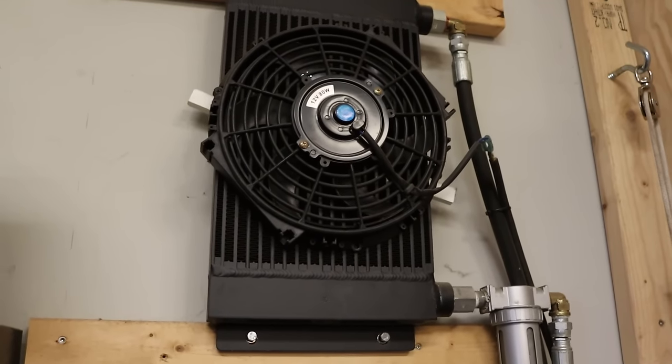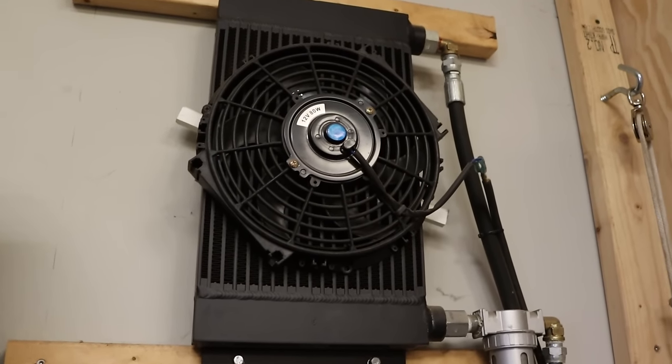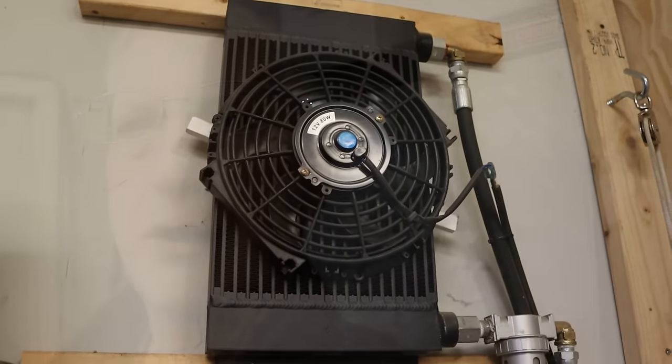As you know, an air compressor, when it runs, heats the air, and when you cool it, the hot air can't hold as much moisture anymore, so you get moisture condensing out, so hence the name condenser. Another option besides purchasing or assembling a condenser unit like this is to run copper lines in an array of U-bends and mount that on the wall. You don't really need a fan necessarily, depending on the type of array you build, but you do need to allow for drainage of moisture and a moisture separator on the output of your cooler assembly.